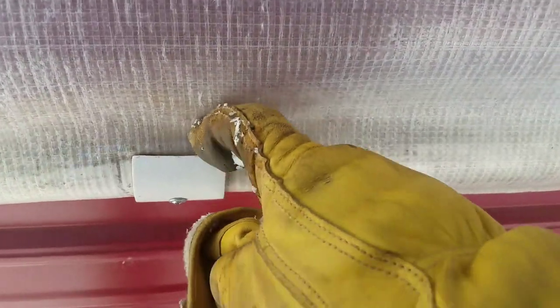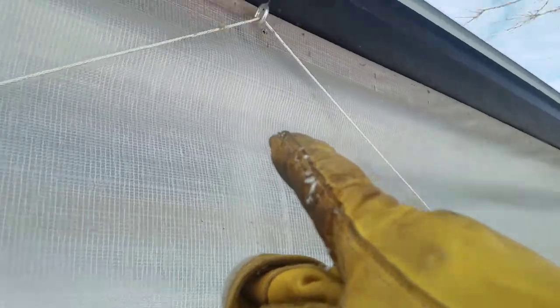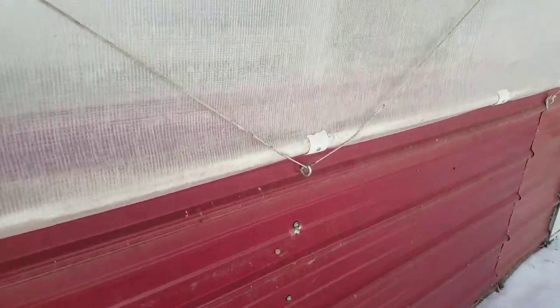Right here I have it wrapped around two-inch PVC — I think two or two-and-a-half inch — and then I took extra pipe, cut it in half, and used it to hold it down. Then right here at the support in the barn I put an eye bolt, went down to the next support, then up to the next support, down to the next, and up and back down. I'm going to redo it though. I want to go up-down-up-down-up because it blows quite a bit and it needs to be a little bit tighter. When the wind blows, the curtains tend to bulge out and pop out.